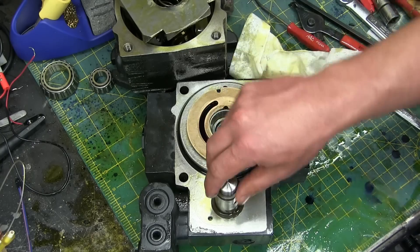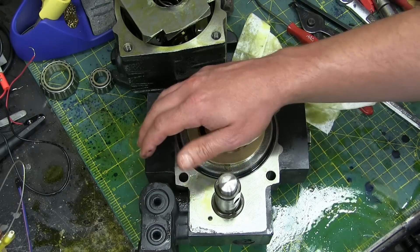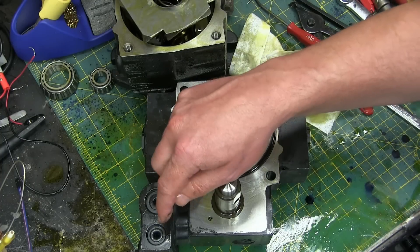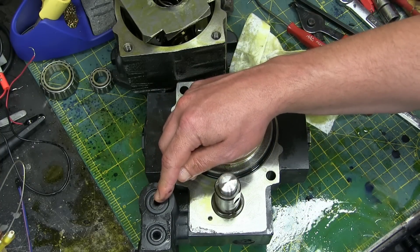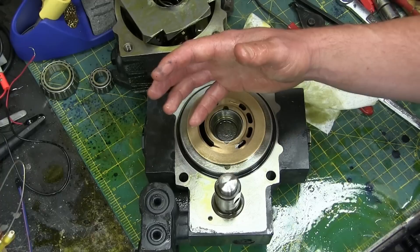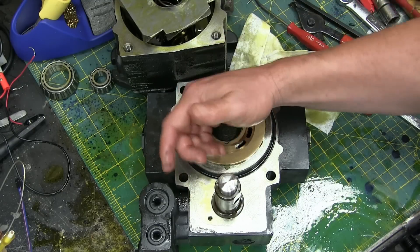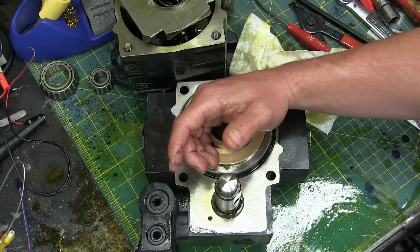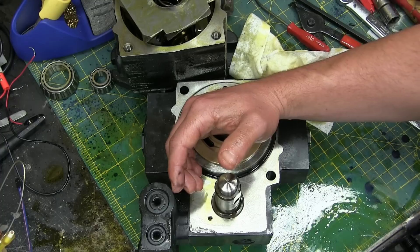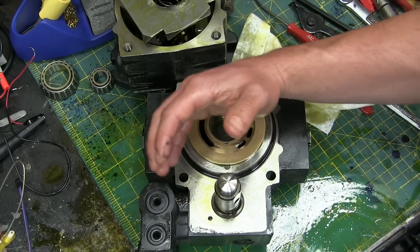This is the servo piston that bears on the swash plate. We are out of time, so we are going to look at the load sense and the pressure compensation circuit in a next video. These are essentially hydraulic computers. We'll also look at horsepower limiting and torque limiting valving — instead of ones and zeros, it's hot, wet oil doing the calculations. It's kind of mind-blowing.